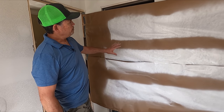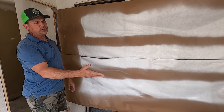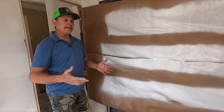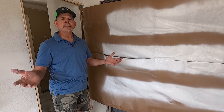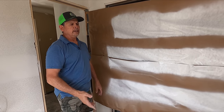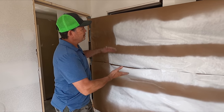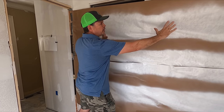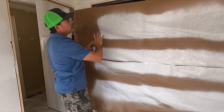Let's do a quick recap. The top one — old filter, old tip, both original to this machine about two years ago. We haven't sprayed a ton through it, and if I had to have an odometer in my head on this thing, like you change your oil every 5,000 miles, I would have said we're at about 3,500. But after looking at that filter, we were probably at 20,000. Old filter, old tip — this paint dried super fast on this paper, meaning there wasn't much product being applied. And a little feathery out here.